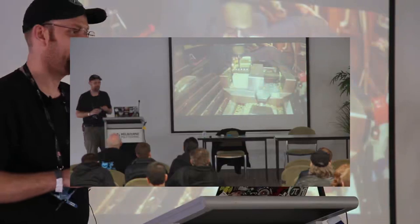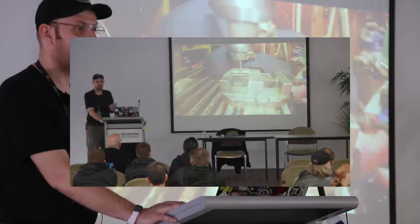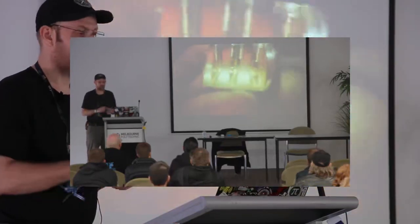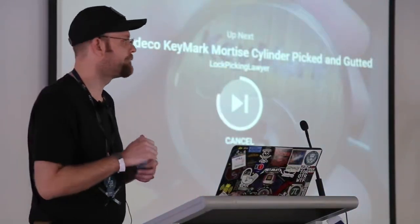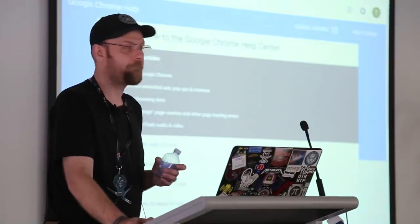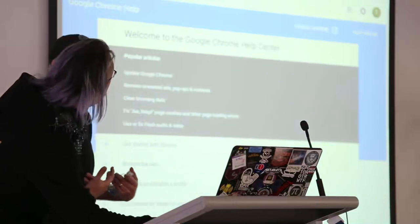Do you have to wait for it to cool down before you go back? No — in this case it was fairly cool to the touch right away. Sometimes they do get hot when you're milling steel. I did a random mortise for someone right before I left — just because of the material used there was a lot more friction. I ended up using oil for it, which is really messy in a six-by-eight shop. Does the material expand or contract? Yes it does — as it warms up it expands, and as it contracts you start having issues where things don't line up the same as they did originally.